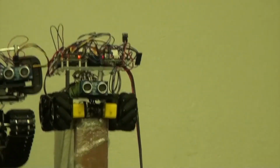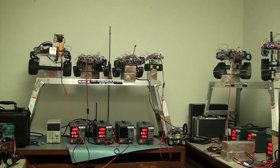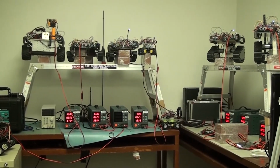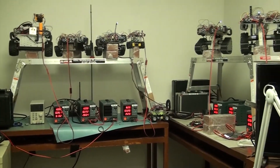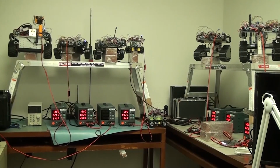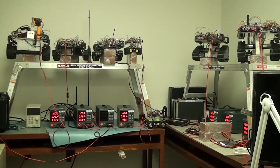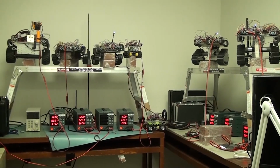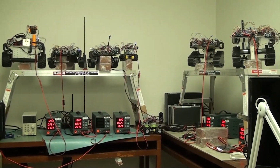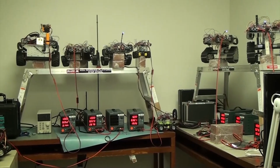And we also have a demonstration of controlling these rovers with a joystick. And that joystick application is actually proving out that we have 2 entities that can communicate with each other through the network of robots, basically through our WebSocket API and our frontline Java server, because the joystick is connected to the same platform that controls the robots. We're reading the potentiometers of the joystick through an I2C device that we've developed electronics for. It gives us a 4-channel ADC. We also have a fire button. And basically we take readings off the joystick. It's connected to the frontline server, and then we route those movement commands to the rover.